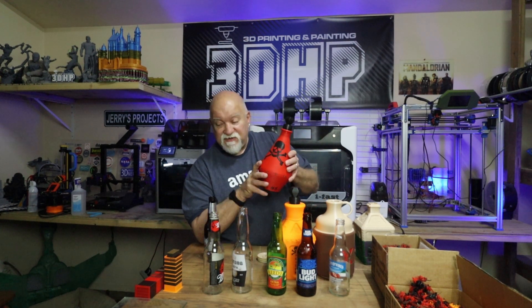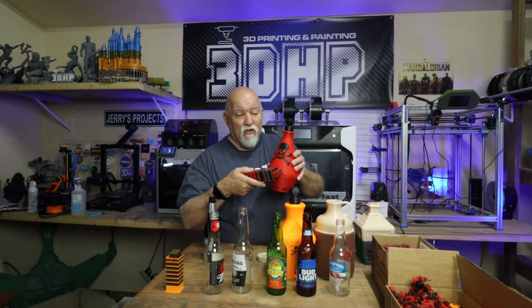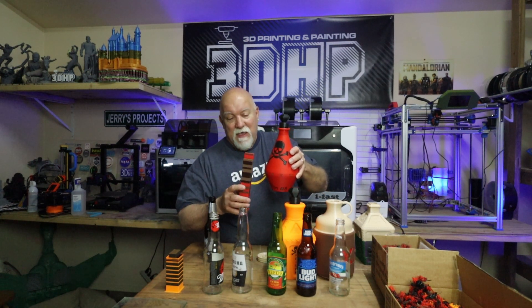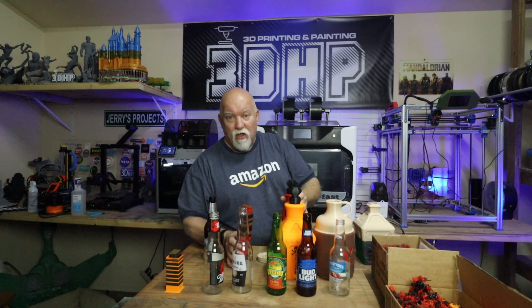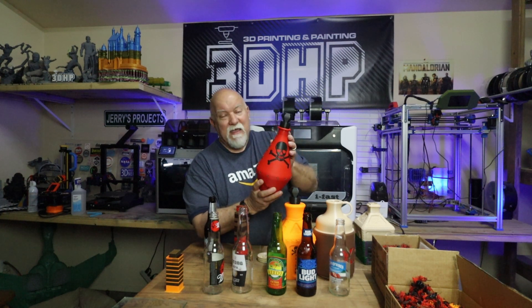When you see the video on this you're going to see my purge tower, which is very tall and big — I know I can refine this and I haven't figured out what I have to do. But this is a ton of filament on top of all the poop that came out the back of the machine. The purge tower fell over while I ran to the store, and this thing was almost done — it had like ten minutes left. I got home, freaking out, and there's stringing on the model. I got some duct tape and taped it down real quick. Even though the head was about a quarter inch higher, it was able to grab most of the purge and stick to it so it wouldn't drag all over the model. When I cleaned this up, there's a little bit of damage — I took my fingernail and scratched it off. That's a shame after printing for so long.